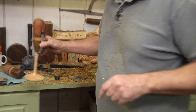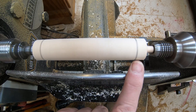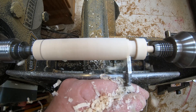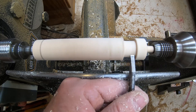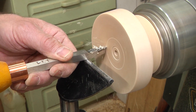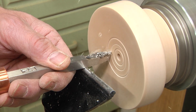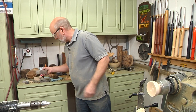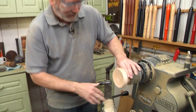Now we need to make the base and the stem. The stem is pretty simple — it's like the little knobs we made, with a tenon on this end already turned to diameter. I'm doing about half-inch relief here, then you just work your way all the way back leaving a matching relief on that end. A little bit of sanding and you move on to the base. For the bottom of the stand I want to leave a nice little surprise — I'm going to center-mark using the Easy Wood Tools point tool, going from both sides to find the middle. When somebody turns that stand over they'll see it. A little sandpaper to take any edges off.